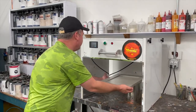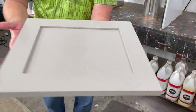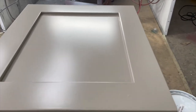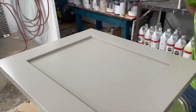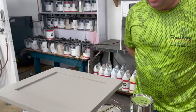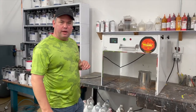If I take this out, you can see right now it's about 130 degrees coming out. No bubbling — looks real good. I'll set it down here so you can see it. That was sprayed very heavy, probably 5 or 6 wet mils. This particular coating is the Acroma Pro Matador solvent-based conversion varnish, applied over the sand conversion varnish primer. This is the first coat. I'll give you a quick overview of how to set the programming and how to deal with troubleshooting.